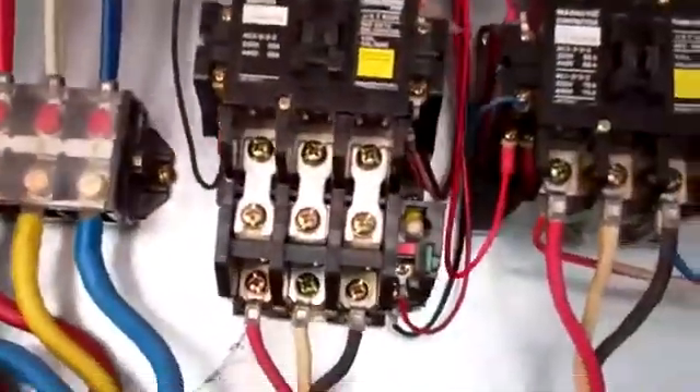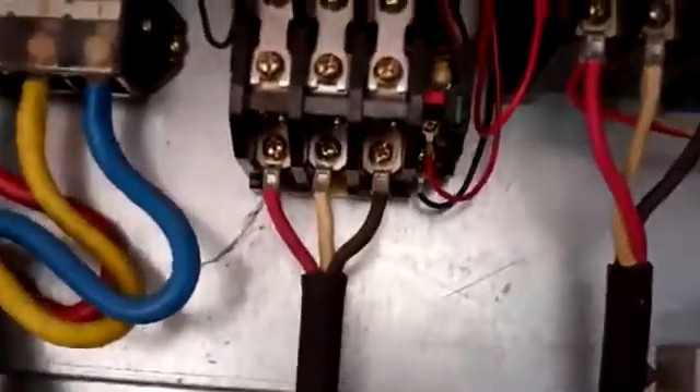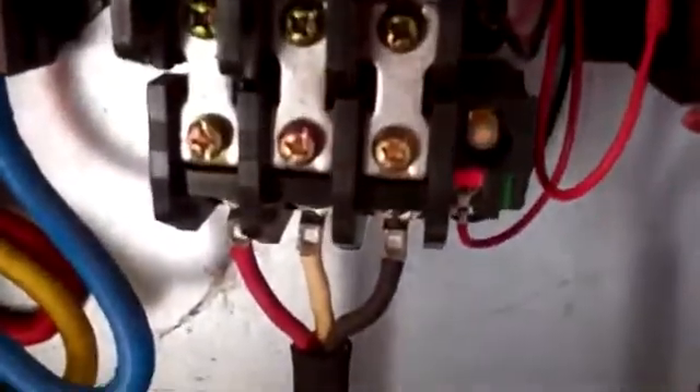I think that's the outlet. We've just gone to run this up and it won't start. We've checked and there's no power coming in on the switch, so we'll have to look at the breaker or something. I've had a quick check on the motor compressor windings and they seem okay — we've got a slightly different resistance on one, but we might not have had a very good connection on where we were testing it.